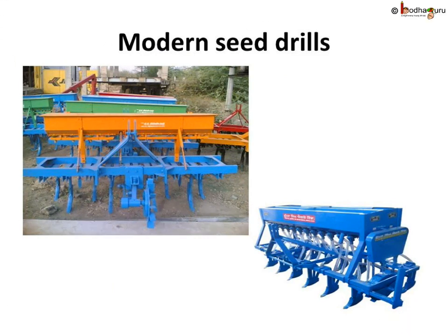Nowadays, tractor-driven seed drills do the job. A modern seed drill is an amazing device. There is a plow-like part in front which cuts through the earth and creates straight furrows of fixed depth. Then it has a seed hopper which puts seeds in the furrow. The harrow at the back of the device covers the seeds after sowing, which prevents damage caused by birds. Thus, the seed drill plants seeds at fixed depth keeping adequate space between them, saving a lot of time and labor.